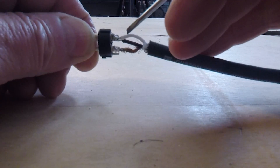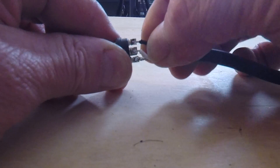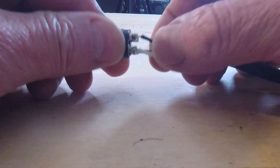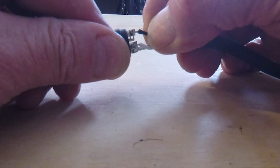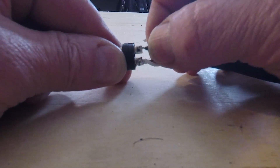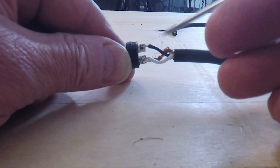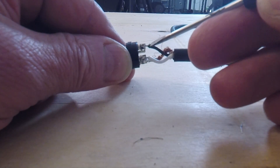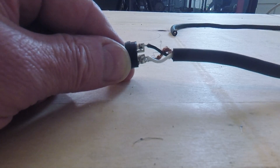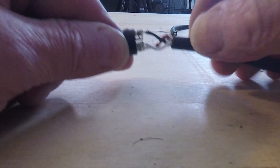This white one is better — that's pretty good. We just don't want a lot of length there because it tends to be a weak point. Ideally the insulation would be right up against the cup. I'm flexing this and seeing that the solder has actually gone up under the insulation, and I can feel that it's rigid — that's good. We don't want the solder to just be there with some flexible wire showing. So we've got the rigidity of the cup and the solder going up into the insulator, and then the insulator taking over, which spreads the stress out and creates more strength. This tinned wire soaked in solder is going to be pretty rigid coming out and then slowly work its way to more flexible — that's ideal.